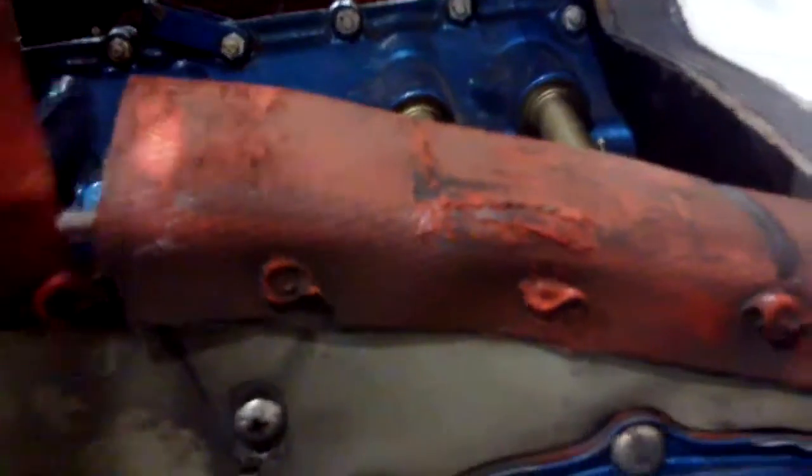From the color on the pipes, both cylinder number two and number four have been getting warm. Looking at this Tiger, we can see we've got some erosion there and a hole. And then we look up at the baffles — the baffles are just shot, and that probably explains why we're seeing heat on the engine. They're just gone. We'll be pulling the nose bowl off in a minute and taking a look further.